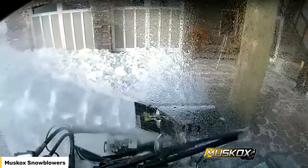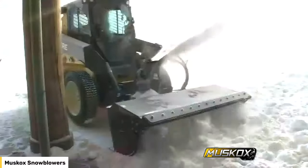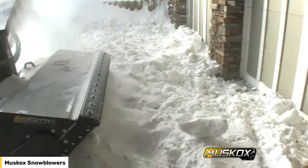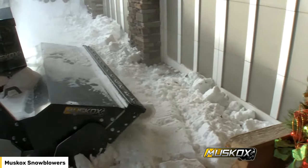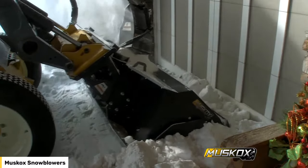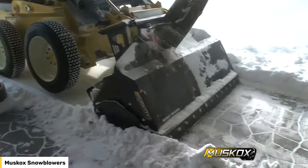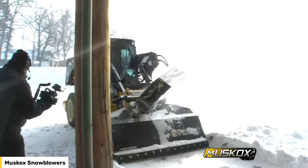You can see now as I'm blowing forward, I keep the snowblower in the lowering position so I can see the wall or door or whatever's in front of me. I don't lift and rotate until I get really about four feet from the wall. You'll see I'm rotating now, turning my chute slightly back, rotating the front of the blower down so it makes contact. You can see I'm blowing in reverse. It looks beautiful, Ron — very nicely done.